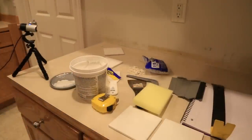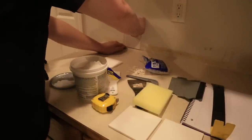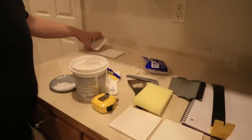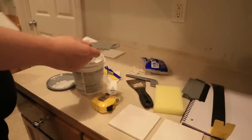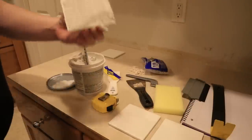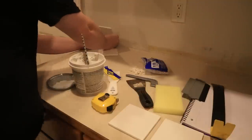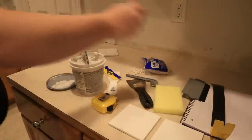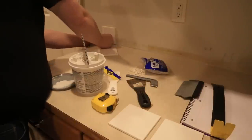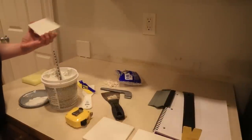I asked the guys on the stream: should I put the tiles flush with the countertop and run a bead of caulk along the bottom, or offset them up a little bit and run caulk underneath? We decided to offset it off the countertop. Adhesive is applied, using two little jack spacers to give lift, and we're placing the first tile. The grout is weird — like liquid sand. They recommend you clean as you go.